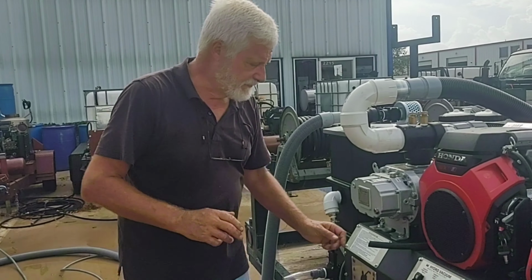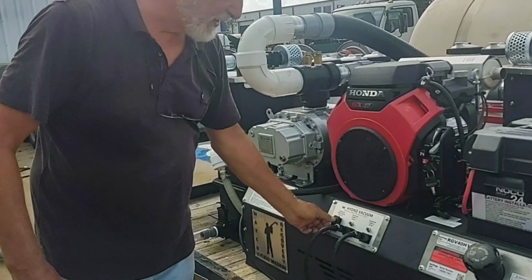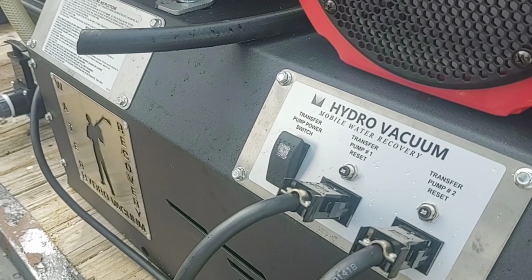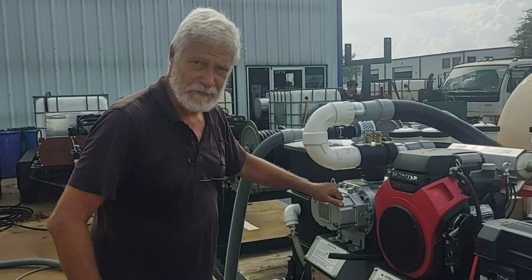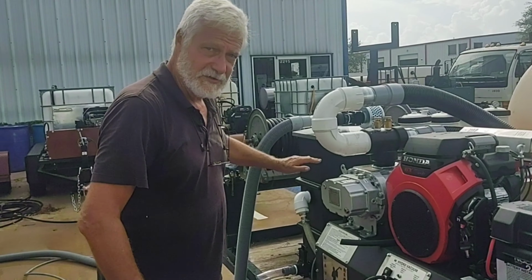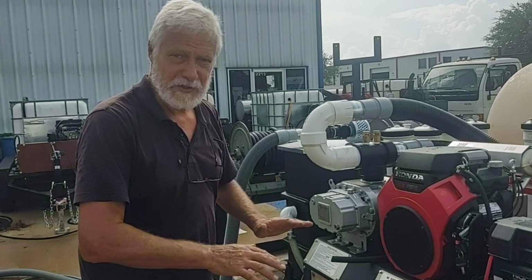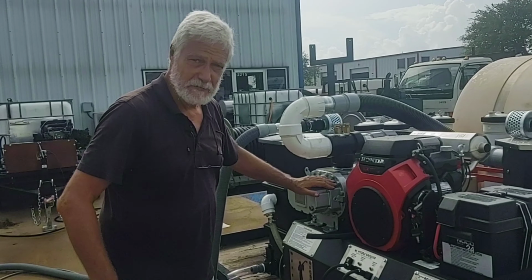There is also a safety feature because in a prior run, I forgot to turn the switch on, meaning the pumps were disabled. And as the water level passed a dangerous level, because you do not want the water to hit the roots blower, because that could be catastrophic. So there is protection. There is a switch that if the water level exceeds a certain preset value, then it'll cut off the engine. The engine will stall. That prevents the vacuum system from operating, protecting the pump.